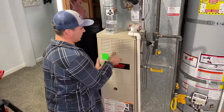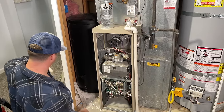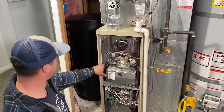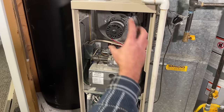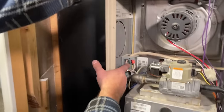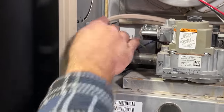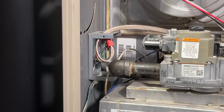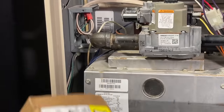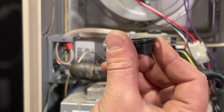To access the electrical, we're going to take our covers off. Our electrical is behind this little box — we'll take that off and disconnect our wires, then pull the whole box off the furnace. Something that's not up to code that we'll be fixing: this wire just goes straight in here. These units will vibrate and there's a potential for this wire to make contact with the case of the cabinet. To prevent that, we're going to use snap-in bushings — they snap in that hole and prevent any wires from making contact with that sharp edge.